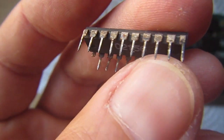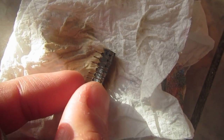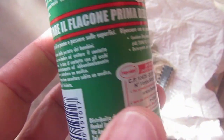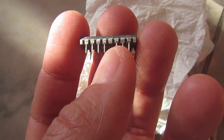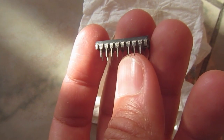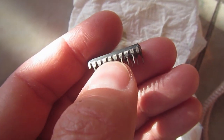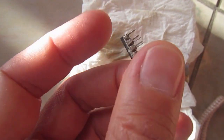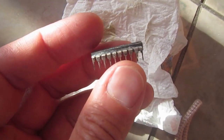It should still work if it's good inside. The first step is to rub the pins very gently with a generic metal polish solution, which will remove most of the oxide. Unfortunately, I've lost another pin in the process — always on the same side. The other side seems better, but as long as a metal stub remains I can solder new pins. Now most of the oxide has gone; next I'll clean the chip with alcohol to remove the excess cleaning paste.